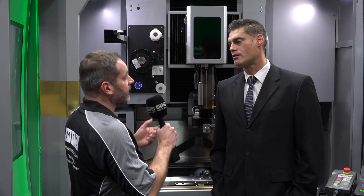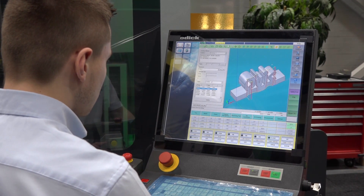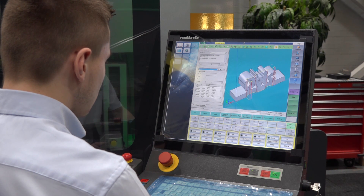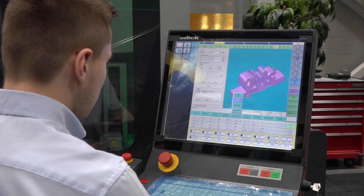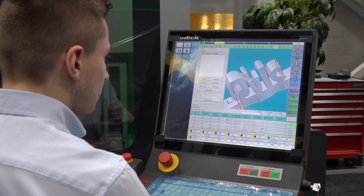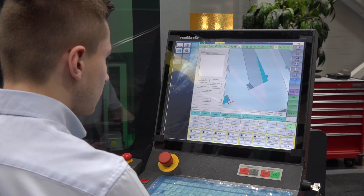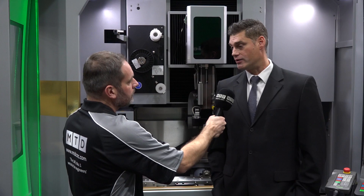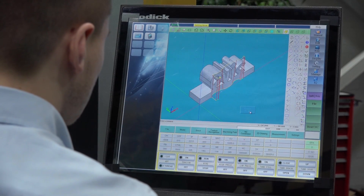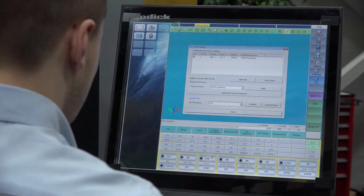The control panel is very different from the SL machine — it's a new 19-inch touchscreen, simpler and more user-friendly. It retains useful features from the SL, including the ability to import 2D models via DXF file and 3D models via parasolid file. The 3D import acts as a translation device: the operator clicks on the model, selects cavities to machine, and the system extracts information to generate ISO programming automatically.